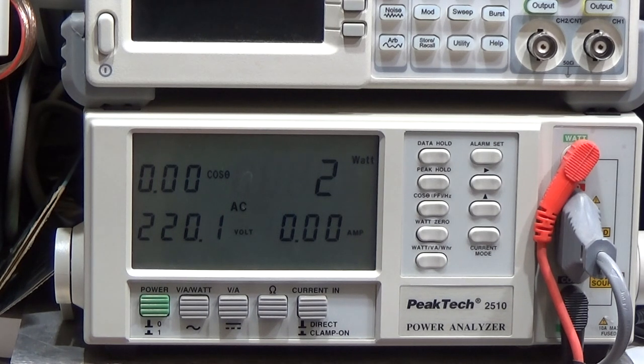The radio tries to catch up, but it cannot really bring up the needed DC voltage to really supply the radio. And that is another indication for the fact that the SMPS is not working here, and therefore let's crack open the radio and see if my suspicion is right that something is wrong with our SMPS.